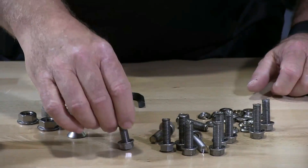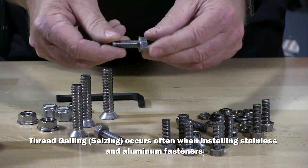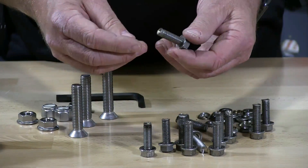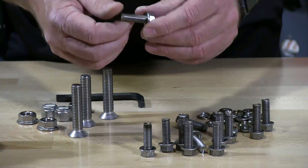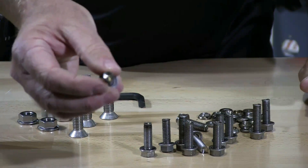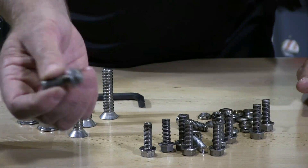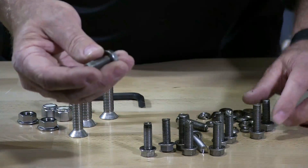Galling is a term mainly for stainless steel, but it happens in aluminum and many other metals. Typically in stainless you'll find this problem of galling, or people saying the nut or bolt is mis-manufactured or there's something wrong with the threads because they go to put the nut on. As you can see here, this is a broken socket cap screw and the nut is still on there because the nut is jammed. The customer actually sent this back to us due to the galling issue.